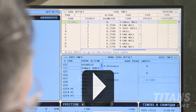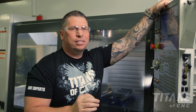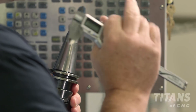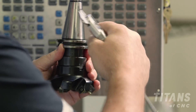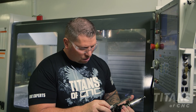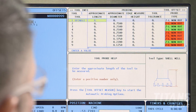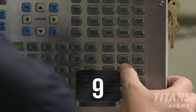I'm going to put three and press enter, then cursor over again. Now it's asking for my length. The length of the tool is an approximate measurement — it's from the top of the flange to the bottom of the insert. You simply use your caliper and double check it. In this case it's 3.920.